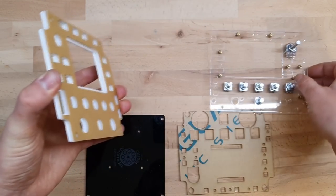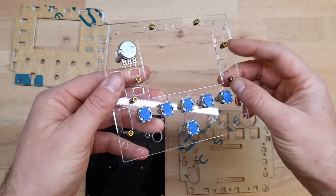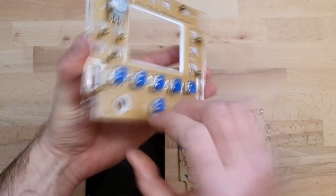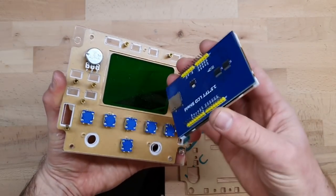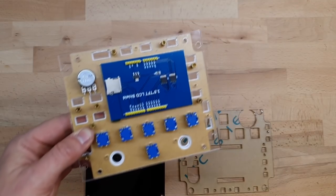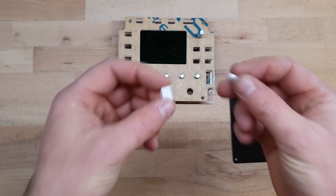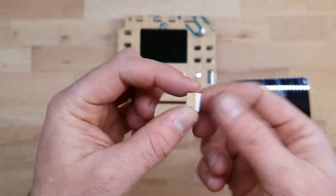This panel retains the rotary encoders and also the motherboard standoffs that hold the PCBs for the tactile switches that the buttons hit. It gets bolted on with those four M4 bolts. The screen cover will go in here - it's just a cheap little 3.5-inch TFT that slots into the larger panel and gets press-fit. The only thing that holds it in place is a bit of foam. This panel, which holds the LED strip, gets bolted onto those motherboard standoffs. For buttons, I use the same method as the rest of the cockpit - small squares cut and glued, retained in the front.